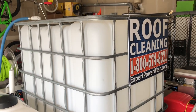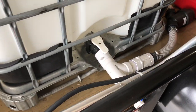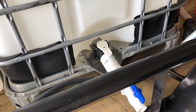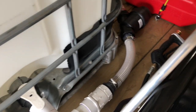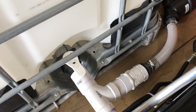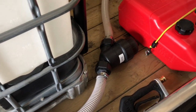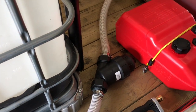We have a 275-gallon IBC tote. Got the plumbing coming out, got a little dump valve there — if you got too much water, you don't want to be traveling with a bunch of water. It's kind of a work in progress, but it's working out pretty well. Got a nice little bend here so it's not really restricting the flow. It's plumbed into a banjo filter — you don't want anything getting into your pressure washer.